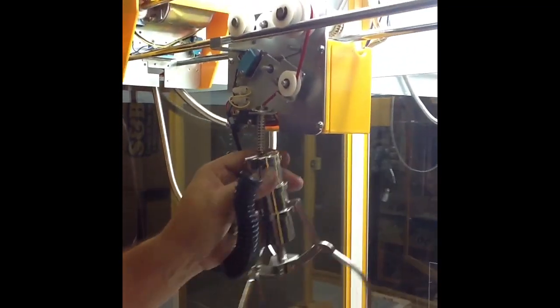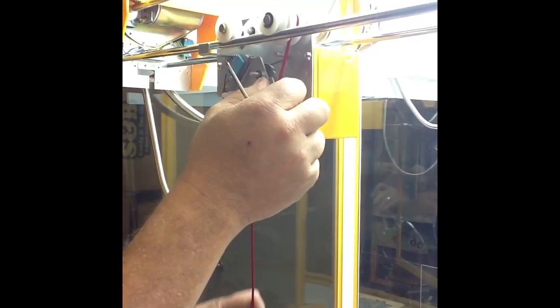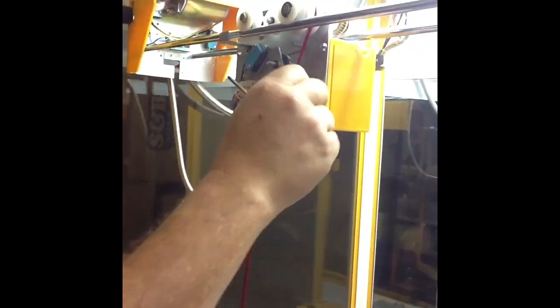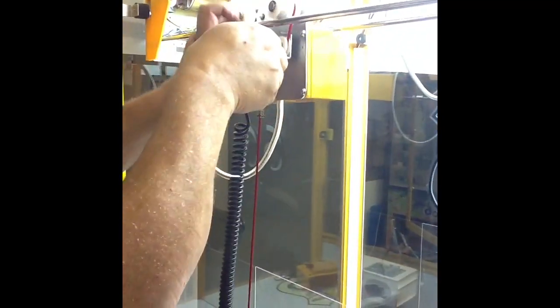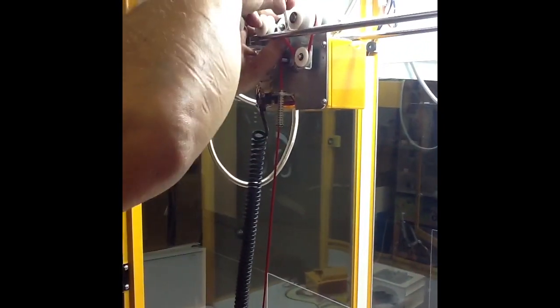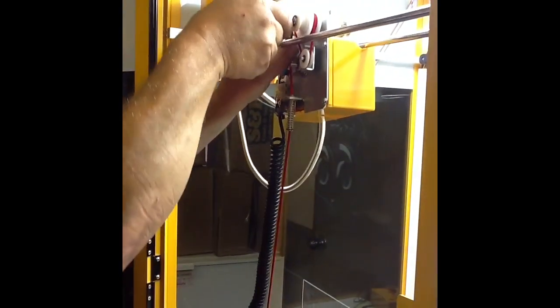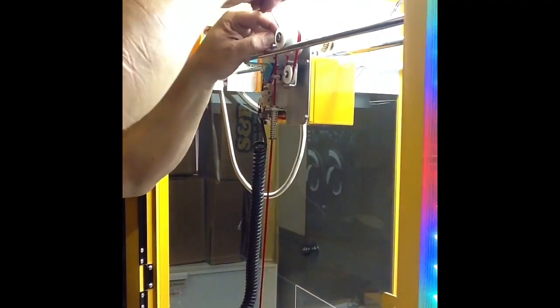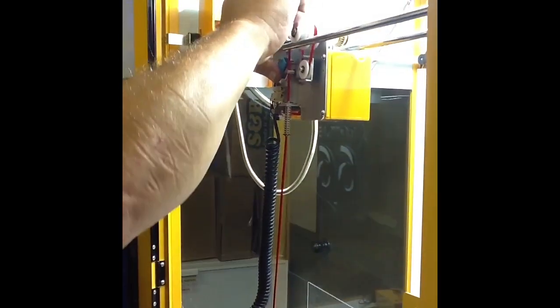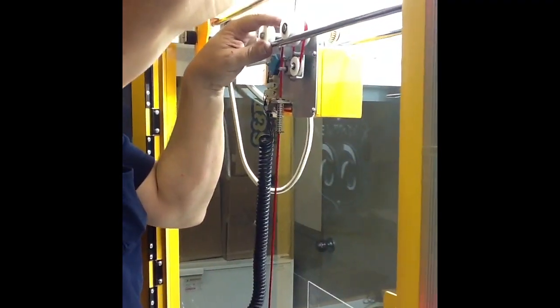The switch has to open. So the first thing you need to do is come in and make sure that your string goes around the right way and is wrapped the right way. If the string's wrapped the right way, you will never get an O1 error code — you can't. So first we've got to make sure everything's in and lined up and the string's wrapped the right way. I'll go back and put the string where it belongs, of course.